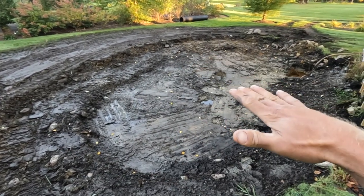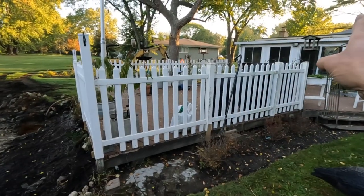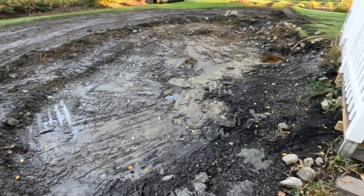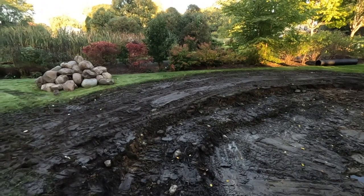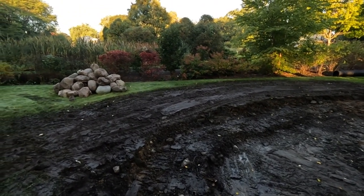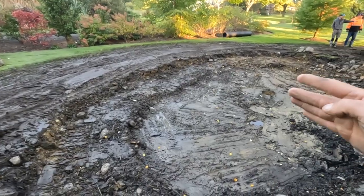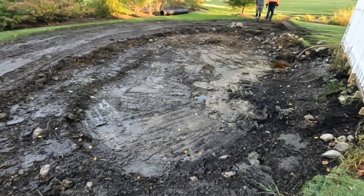Here is the canvas we're working with. This used to be occupied with about two feet of cattails. DK was out here yesterday and cleaned everything out into a roll-off dumpster. He also dug a few potholes, and you can see we are accumulating groundwater here, so we're going to have to take that into consideration and do an under drain system. Back along this berm we are going to do a waterfall, a wetland filter, and then that will transition into the pond at 16 by 16 feet.